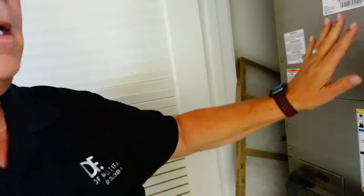Now we're at the air conditioning unit — this is our indoor air handler. You want to make sure it's all covered, all the screws are in your panels, and you don't have a lot of dust build-up around it. It really looks nice when they open this door and see a clean air handler. Make sure you've got your filter — replace it on your turn. We like to leave an extra filter in here; it gives the residents an incentive to change these on a regular basis. We do quarterly filter checks, but a disposable filter is really only good for about 30 days, so leaving an extra filter encourages the resident to go ahead and replace it themselves.